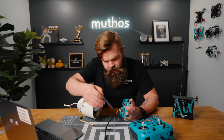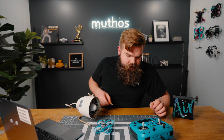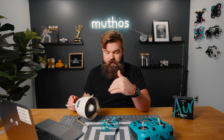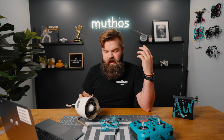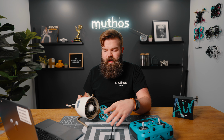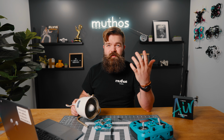But we'll go to bind, and then we will poke the Crossfire button down here. There it is. All right, should be binding. Yes, we are going to update it, and then we'll just sit here and wait. So this fan probably is not necessary for this. I do know that updating the DJI O3 Air Unit, you had to use a fan. I just like keeping a fan on these things when they're plugged in, because I don't ever want to burn a VTX or anything like that. So just better safe than sorry.